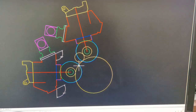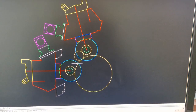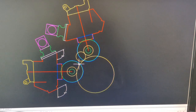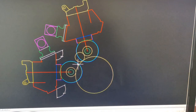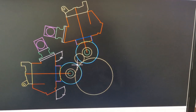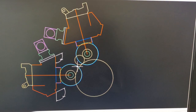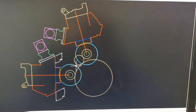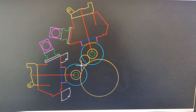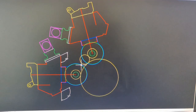The whole base of this bike is based around building this crankcase and engine to fit in a fairly late model R1 Yamaha. A YZ250 makes about 52 horsepower, so this is theoretically a 208 horsepower two-stroke race or even possibly street-rideable bike. The gearing will be a lot different from the R1 — the R1 is around 12,000-14,000 RPM, but this will basically be an 8,000 RPM engine, so it needs a lot of secondary gearing and the final drive chain will have to be about a one-to-two ratio.